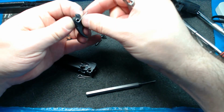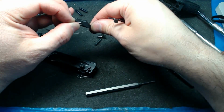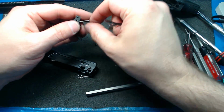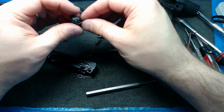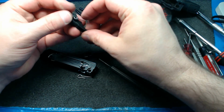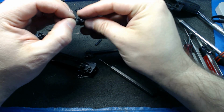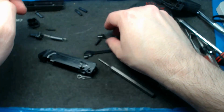And it's also the return force, which after you pull the trigger, returns the trigger to the forward position. So it has two functions at once. It's your trigger return spring, and it's your trigger bar lift spring. And again, all held together by the pin in the middle. I'm going to leave this partially assembled for now, just because it might be helpful illustrating something later.